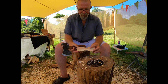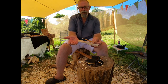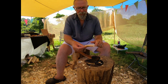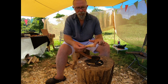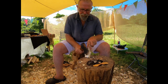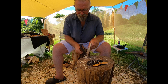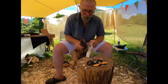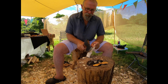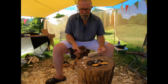There — done. So we're getting there now, we've got a nice handle going on, we've got the crank in the bowl, and now we've just got to take the front of this block of wood out to bring the front of the bowl up and give the bowl a curve. So from the middle forward, take that corner off — from the middle forward, take that corner off — and then from the centre, start axing in, get a little groove going, drop the left hand, drop it, and there we are — we've got the start of a curve. Okay, and there's your blank — that's what you start with.